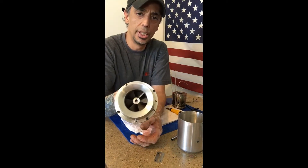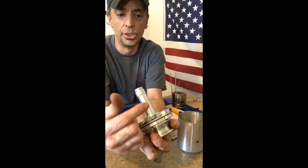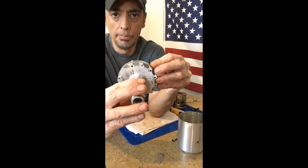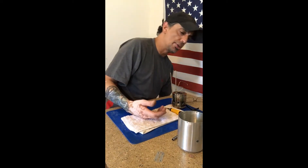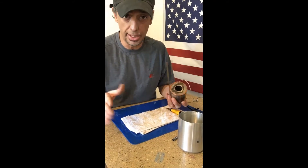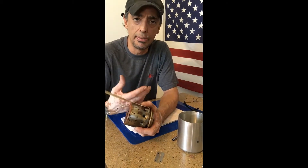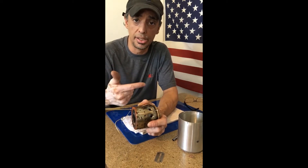It's not a burn, it's just burnt oil like in your pan or something. This is the front head. I got away with just four screws — they hold the diffuser to the nozzle and keep it centered. Originally I had an oil line in this one and I plugged the hole. Instead of using a completely separate oil line, I wanted to minimize accessories. Even propane is too much for me, but we have to get to the next phase — incorporating a ceramic tip glow plug that has kerosene injected onto it to ignite the kerosene, not your standard RC glow plug.